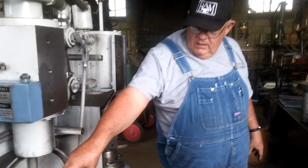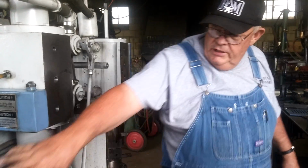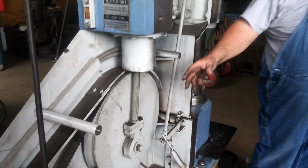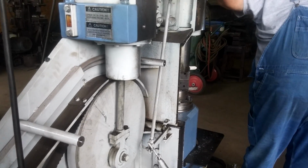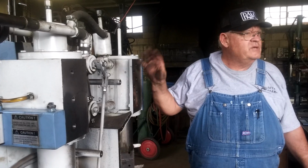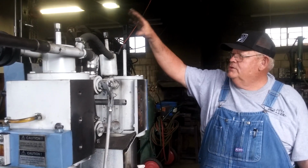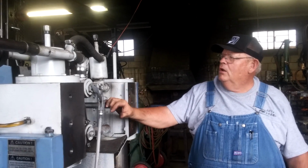Door on a hinge, as there's one back there to service the belt. Then there's a cover here and a cover here with louvers for airflow, so that we can get airflow through here to get rid of the heat out of the hammer. Anytime you're compressing air, you're creating heat. There's a hood that goes over the top of this, makes it all look really nice.